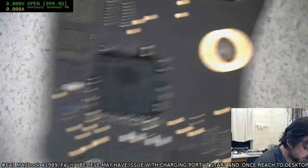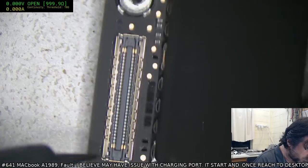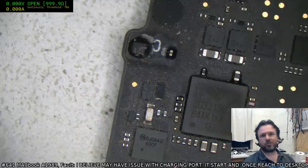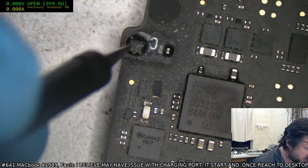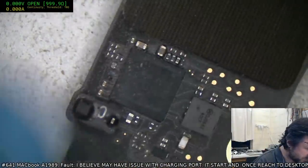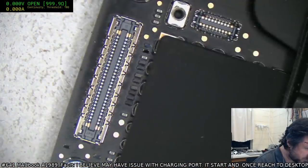In which case, it might well have been a high voltage. Yeah. So, whatever came through was probably of a high voltage. And the reason why I say that is because your fuses blow based on the current. And if you have a high voltage, it's easy to get a lot of energy into the chip without actually blowing the fuse. So more than likely it was a bad power brick, or a brick had a fault with it. That would be my guess. But it is interesting that it actually does boot. I find that rather perplexing. And everything else seems fine, so it was definitely whatever it was plugged into.